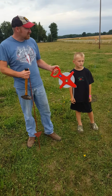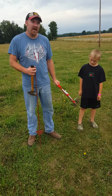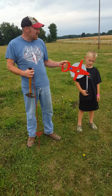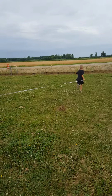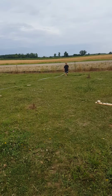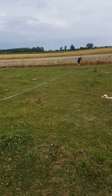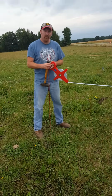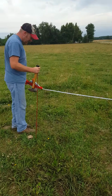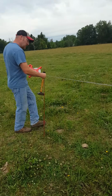We have a fence that is put up at 33 feet at the road. And so what we're going to do is we're going to take that 33 feet, go ahead bud, and we're going to measure back 70 feet. The reason we're going to measure back 70 feet is to make sure that we meet the 67 foot that we need, plus the 33 for our 100 foot. And we'll put a 3-foot extra factor on it to make sure we're not too close to the road.